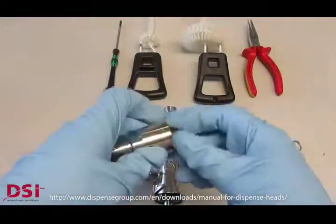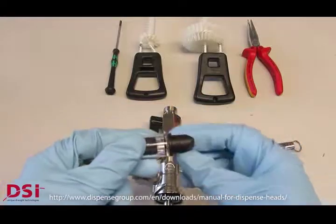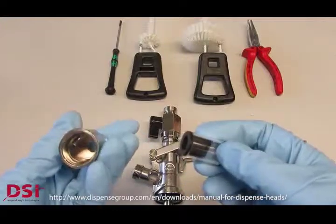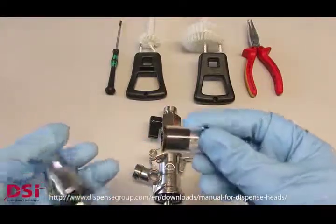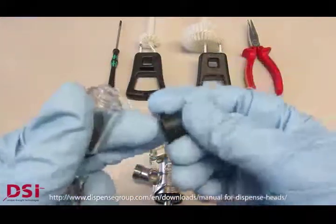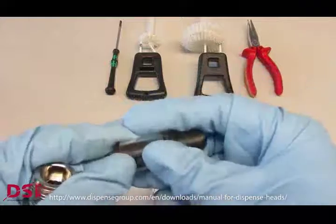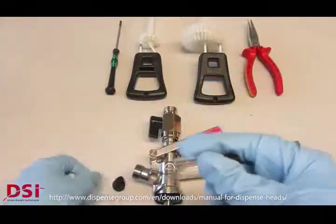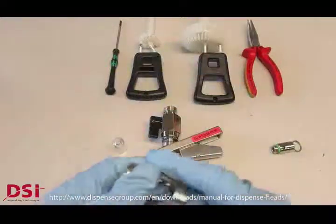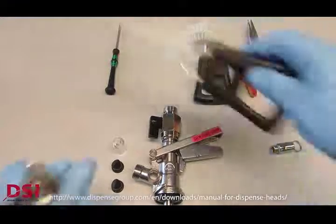Here we have the CO2 double lip valve connector with spy hole. Remove both non-return valves. It can happen that there is beer between both valves, just in case the first one is destroyed, and therefore we have the spy hole in order to check if there is fluid, beer or beverage inside.